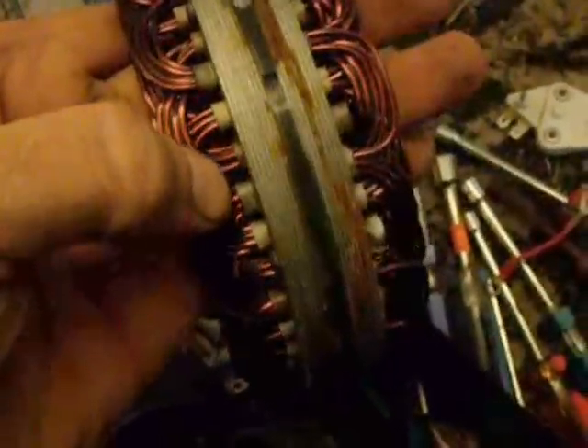That's what the inside of this looks like, and that's what you have to buy to get it. There's a link on my webpage to that regulator on eBay. There's nothing special about the stator — it's a regular old stator. You can get a low RPM stator and put it in this and it won't make much difference. It'll just turn it from a 60 amp alternator to about a 35 amp.